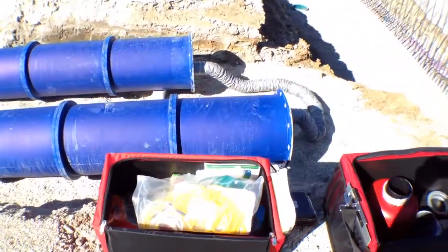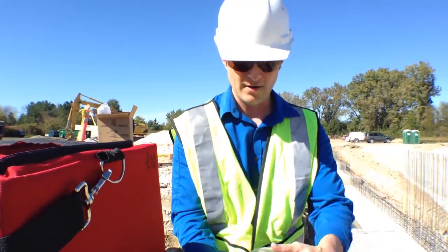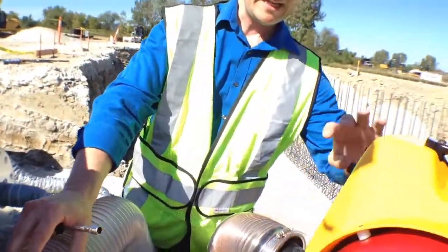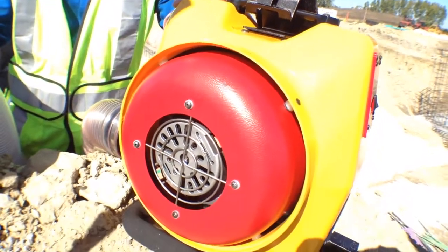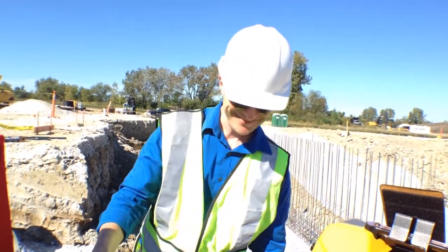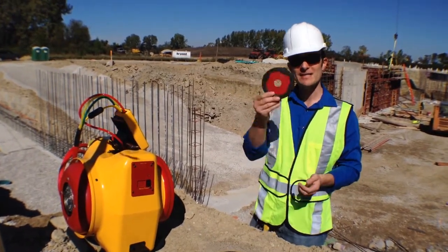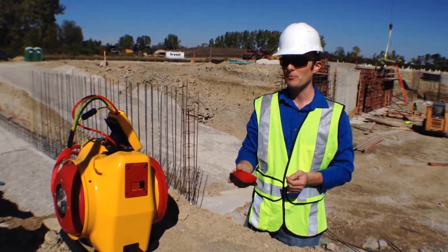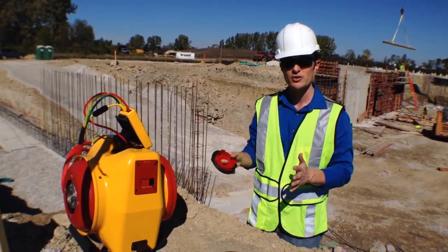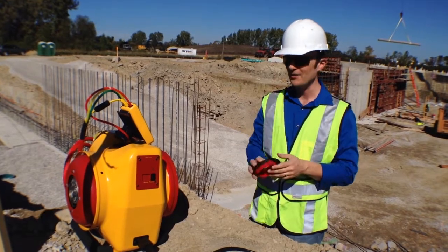This whole setup is considerably more hardcore than the other duct testers from Retro Tech. We've got all hardcore fittings, and this flex duct is very very thick. Essentially this outlet right here is the pressurization — it's basically a scientifically calibrated leaf blower. Since we're testing these for their ability to block air leakage and water leakage, I'm using the smallest flow ring that I can possibly fit on this fan. We're going to take it up to two inches of water column, because that's the max these ducts are designed to withstand during normal operating conditions.